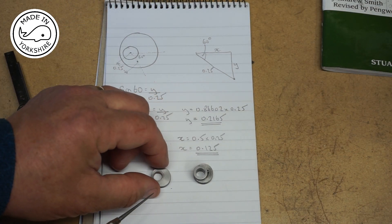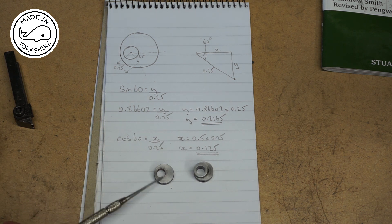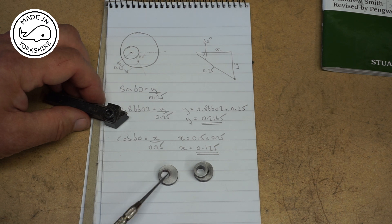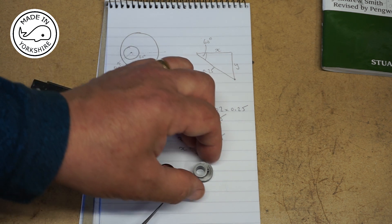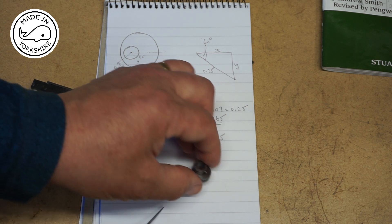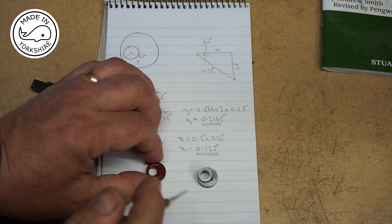This is the sheave I've just made, and that's the sheave taken off the machine. That one's got a boss on it and this one doesn't. I had a bit of a parting off nightmare where the tool dug in when it hit a hole and made a bit of a mess of that face, but I think we're okay because that face will face onto this one. What I need to do with each of these is drill a hole that will take a little pin.